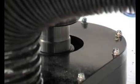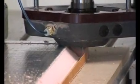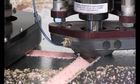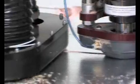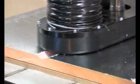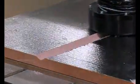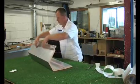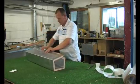The Axyz Ductmaker features two spindles, allowing two tools to be run consecutively, maximizing efficiency without the downtime associated with changing tools. A typical configuration associated with cutting phenolic foam is spindle 1, a profile tool used for cutting edge profiles, and spindle 2, a V-groove cutter, used for cutting the material to allow easy bending. This assists and speeds up the fabrication process.